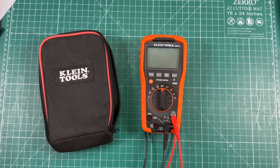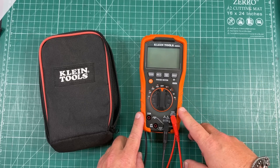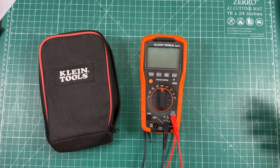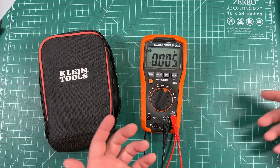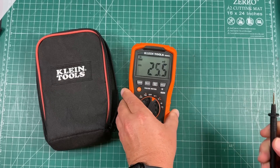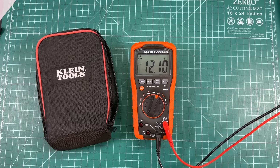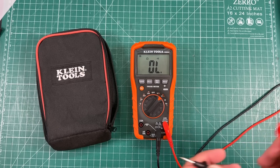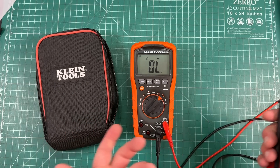I use a variety of different meters depending on where I am and what I'm doing, but primarily when I'm at home, this multimeter from Klein Tools — the MM600 — is my main workhorse. I bought this at Home Depot years ago, right after I moved to Texas, and this is what I use for testing everything voltage and continuity-wise. It works great and it's accurate. The only thing I don't like is it's not auto-sensing. So right now it's on AC — when you turn it to voltage it goes to AC, and I have to push the select button to get it to DC. But it's accurate enough: I've got my power supply set to 12.1 volts and as we test it, you can see we're right at 12.1 volts. Certainly accurate enough for this amateur.